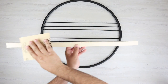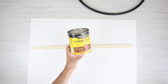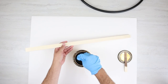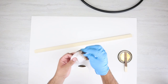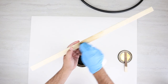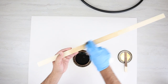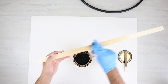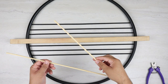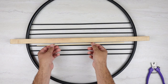Before staining this piece, I'm just going to go ahead and sand it down a little bit, especially the end where I cut, just so we have a smoother surface. Then I'm using Early American Minwax stain to give this a little bit deeper color. One thing I like to do to keep it a lighter color is to stick my rag in the stain and then dry it off a little bit, so I'm not completely saturating the wood — just using a damp cloth to rub on there gives it a lighter color.